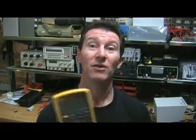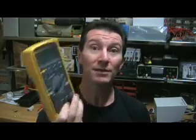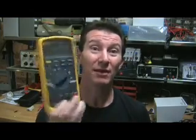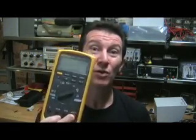A lot of people seem embarrassed that they don't know that their meter is not very precise at all. And that goes for virtually every meter on the market — there are some that are almost an order of magnitude worse than this. Price really doesn't have much to do with it. You can pay $2,000 for a multimeter and it's still going to have the same problem. Just be wary of it. Burden voltage.